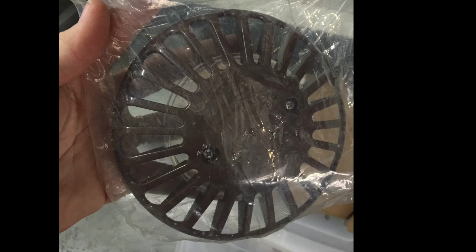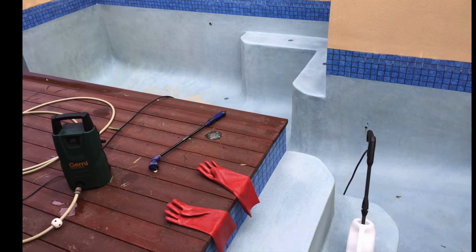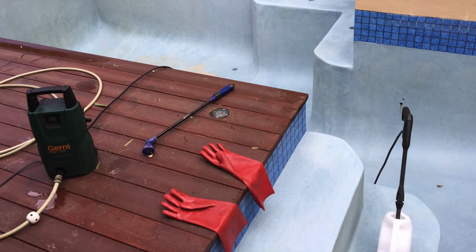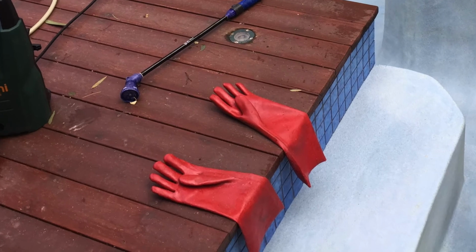But with those reinforcement fittings coming through, that is just going to keep on staining. So that was our way, just a bit of dig it back, put silicone over it to keep the water off it and stop the rust stain coming through, and then put a cover over the top of the whole thing.